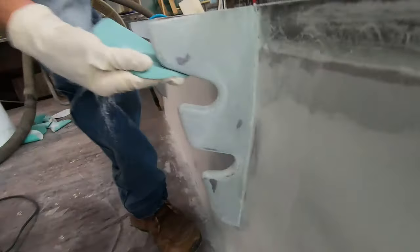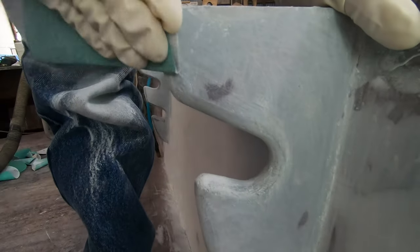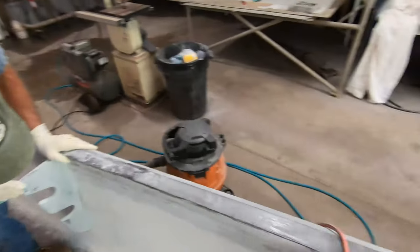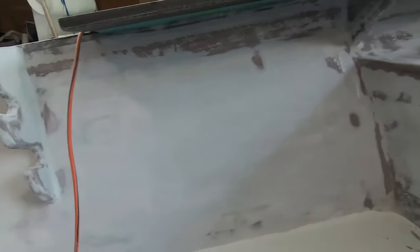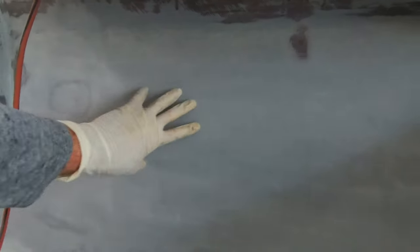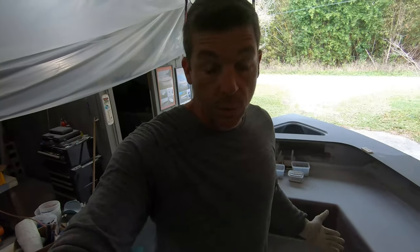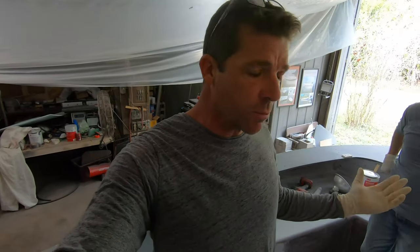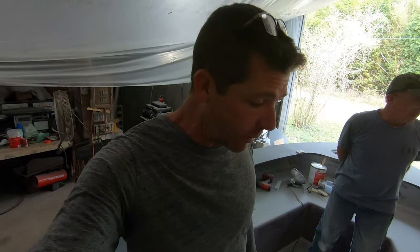We're kind of fairing in these corners, detail sanding. Those are going to be for our gaffs and hook poles and rod holders, and we've got a whole series of them. We've also gotten all of this fared, shaped. You can see where there's raw fiberglass sticking through, but all this is going to be is filler. That's going to produce a nice semi-smooth first finish. We're not trying to go yacht caliber in this boat. It's still going to be like a work boat, but it's going to be much smoother than what you would see just in, like, our Kenner, for example. We're not doing the splatter finish like we would do on it.